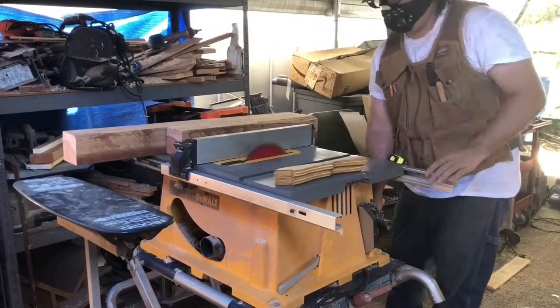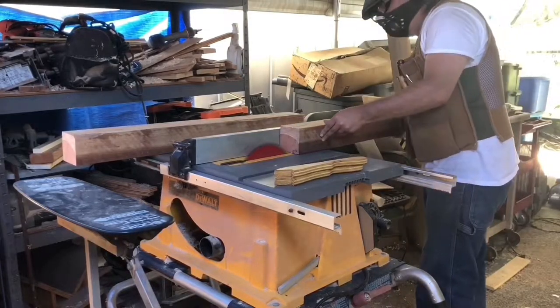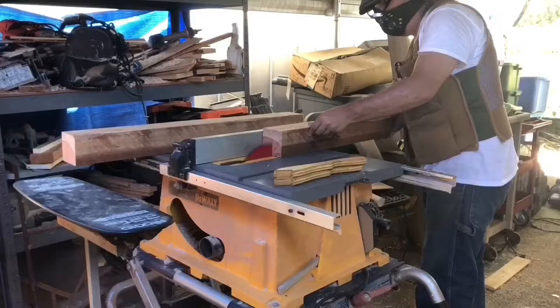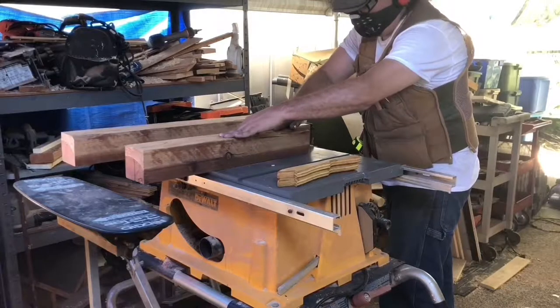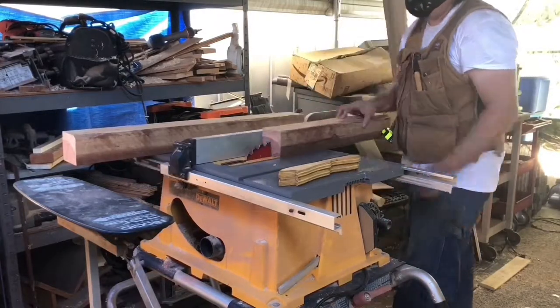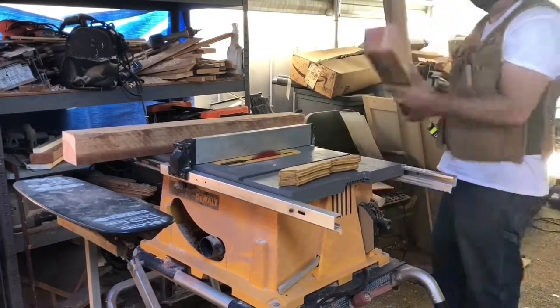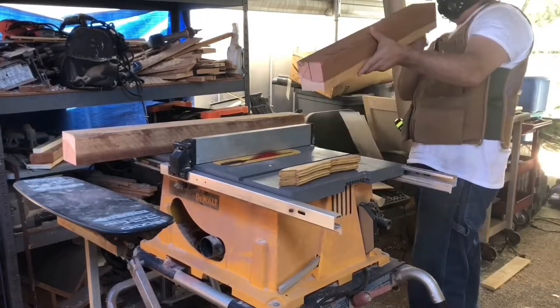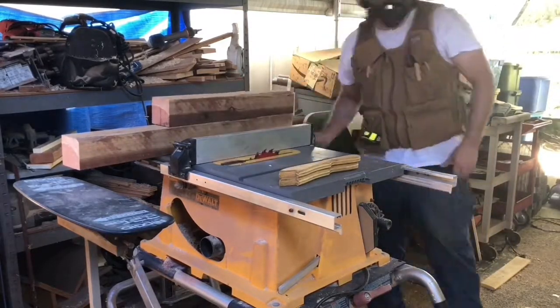So earlier I talked about how my dad's craftsmanship was doing us proud. Well, here's me making us look stupid. Whenever I'm about to do something, I think, would an idiot do that? And if they would, I do not do that thing. Now normally dimension lumber is good enough to start milling at the table saw, and I just assumed I could, but about halfway through it just felt wrong. At first I thought I was cutting too much, so I lowered the blade, but it still wasn't tracking right. So I checked it, and it was way off square.